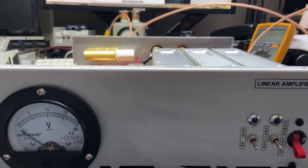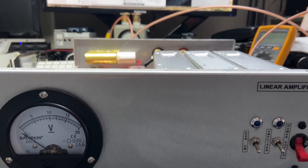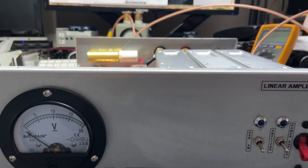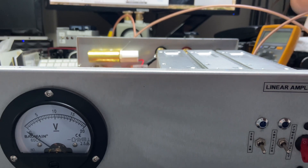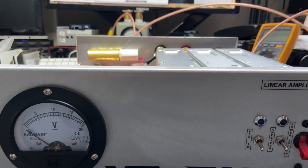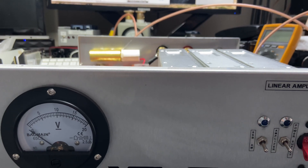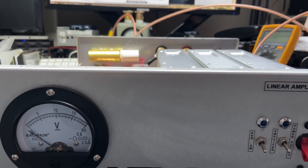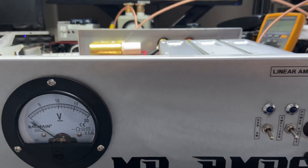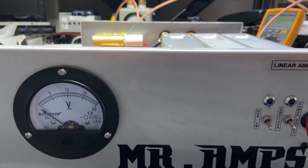The parts that burned — in order for those particular parts to burn out, the temperature has to increase over 157 degrees Fahrenheit. That's extremely hot for this amplifier. I have two fans on top that provide over 104 CFMs each, so he's getting about 200 CFMs total, at about 6,500 RPMs. That's a lot of air for this particular amplifier.